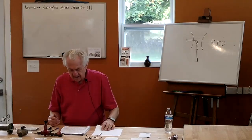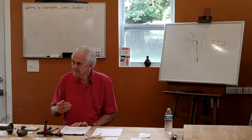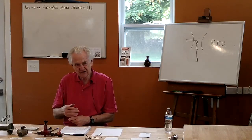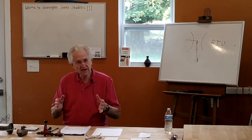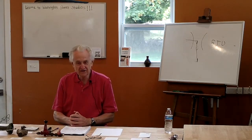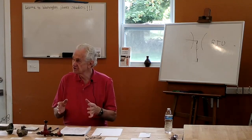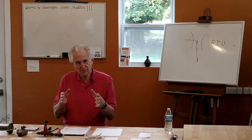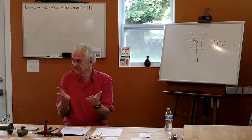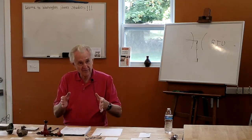And the burner size is based on the kiln design and the kiln size. Basically what you're asking is, how much heat input do I need to raise the temperature of everything in the kiln, and do it fast enough to offset the losses? Because when you're heating up a kiln, you're losing heat constantly. Heat is just coming off the kiln. When you talk about the efficiency of a kiln, what you're really talking about is how much of the fuel I put in is actually going to heat up what I want to heat up, meaning the pots. We've got kiln shelves in there, and we've got the kiln itself. That's all basically wasted heat, because all I really care about is heating up the pots.